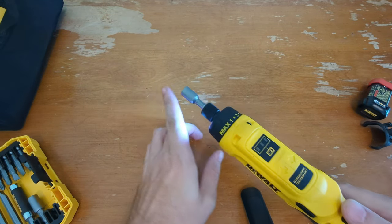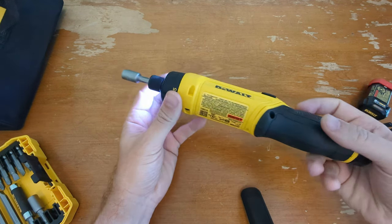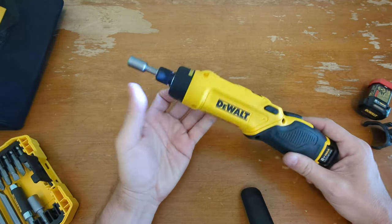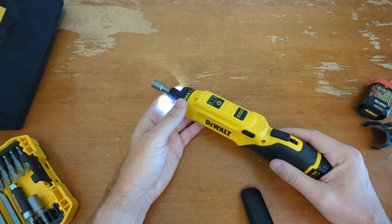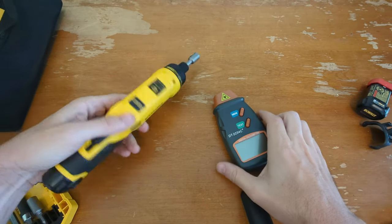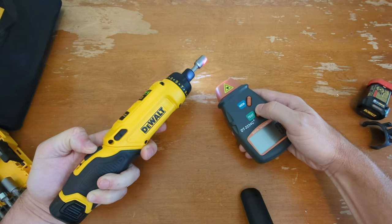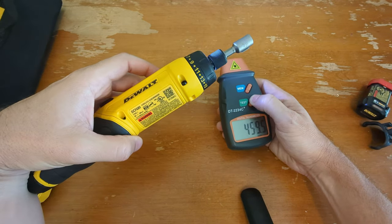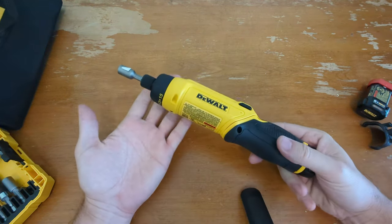At the same time, if you're on a screw before it gets tight, you can push that button and hammer it and it will go full speed. This thing tops out allegedly at 430 RPM. Let me check that — I'll break out the tachometer and see what kind of speed it really does get. All right, with the tach — yeah, about 460 RPM. So rated speed 430, it's hitting 460. That's pretty great. It does what it claims as far as RPMs.